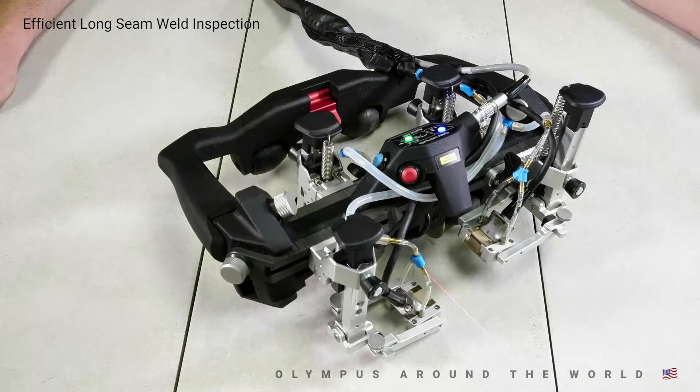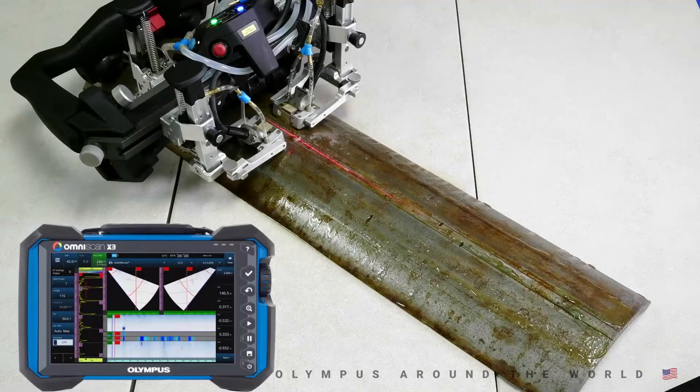Having these tools and information right at the fingertips of the operator without constantly monitoring the X3 allows for a one-person crew while efficiently collecting good data. The Axiom's design has really simplified the role of a scanner technician and made it easy even for the entry-level technician. For longitudinal seam welds, we can scan from 6-inch OD all the way to flat. Now let's get into the action.